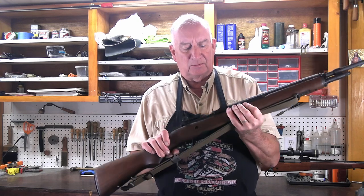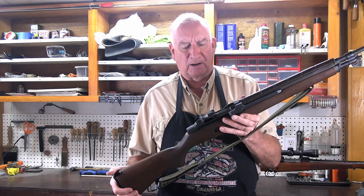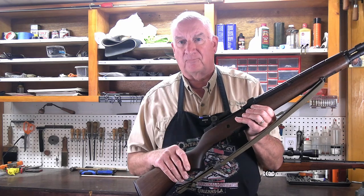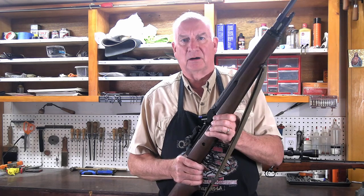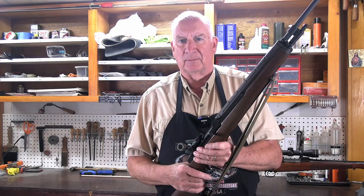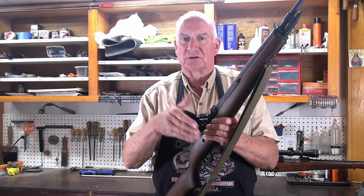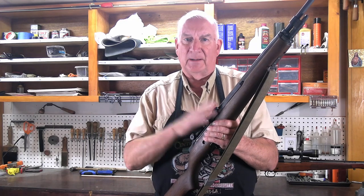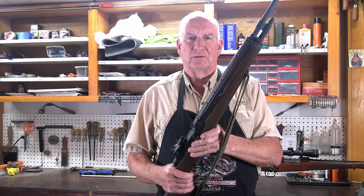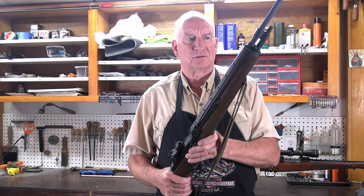Tolerance was the name of the game. Tolerance has been, until CNC machinery came on the scene within the last few decades, something which was always first and foremost with any parts that had to come together. They didn't want to be stalled out by all of a sudden having the production line come to a halt because receivers and stocks were so tight that somebody had to start chiseling and filing away. They wanted to be able to just slap these guns together and get them down the line. So tolerances were established in order to make sure that there were no headaches in that regard and no slowdowns, no traffic jams.